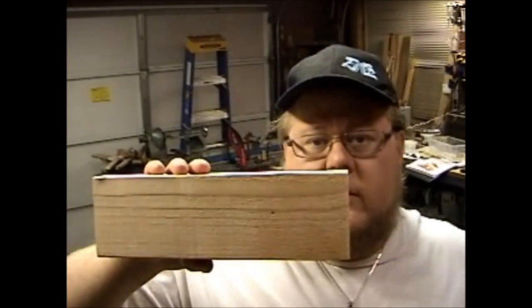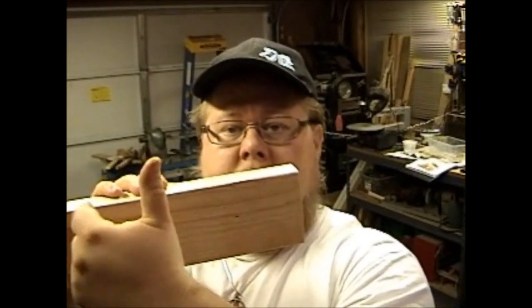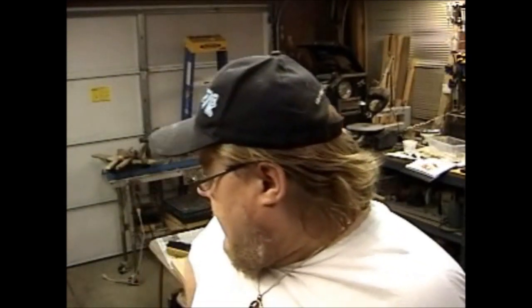What I may end up doing is cutting into the 2x4 and actually slicing it so that I can cut a U out of this part of the wood, but that will make the ends very brittle, so I probably won't go quite that far. What I may end up doing is seeing if I have a heavy enough blade to try and cut wood that thick on the scroll saw and just go very slowly. I highly doubt it, but it's worth a try.